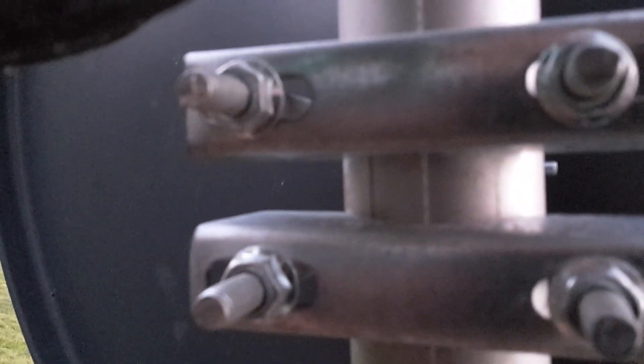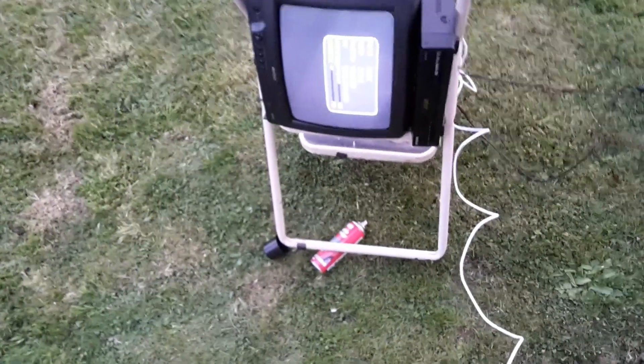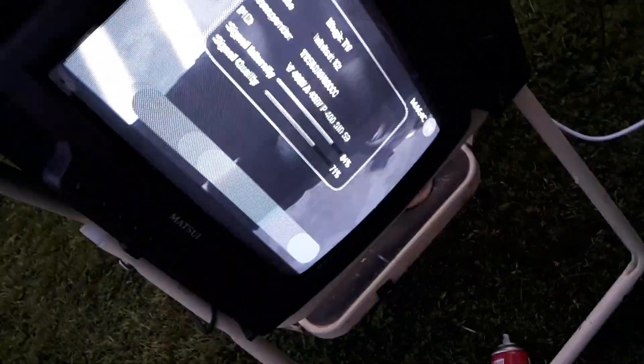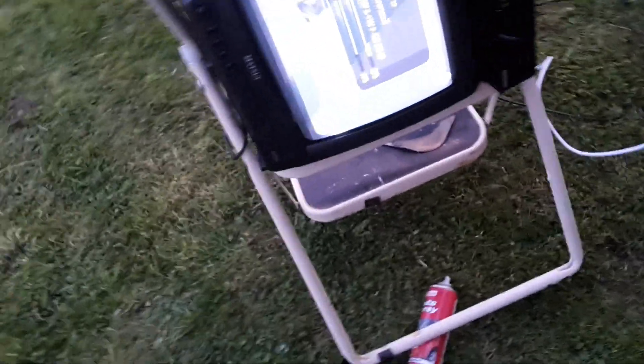A couple of important things: you want to make sure that the motor is completely centred on the bracket — if it's anywhere out it will throw the whole thing out. Make sure everything's loose enough to move but not going to slip down the pole. Waiting for the satellite at 45 degrees east to come through — and we've got a signal on there, coming in at about 72%, which I know we can get better. Moving it, it's kicking in at 75-70%, so I do need to adjust that a little bit.